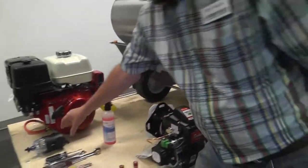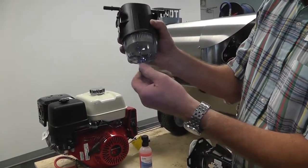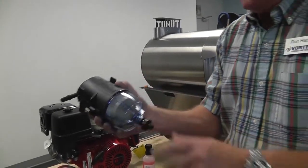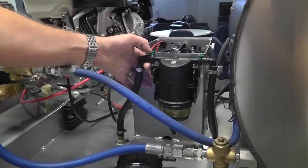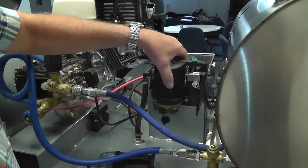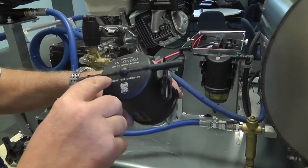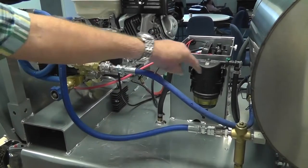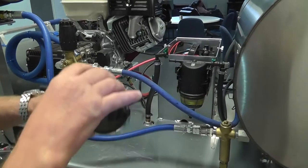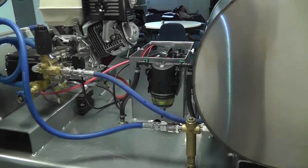For changing the fuel filter, we went with one where you throw the filter away. You can drain the bottom by opening that up — that'll drain the water and sediment out of the bottom. If you see that the fuel filter is bad, you're going to lift up on these green tabs and push down. You can grab ahold of this filter here and snap it right off. When you go to re-put it in, there are arrows on the top, so you want to make sure the fuel flow is coming out of the tank going into the burner, with those arrows aimed towards the burner. You snap the fittings back on, push the green down, and you've just changed the fuel filter.